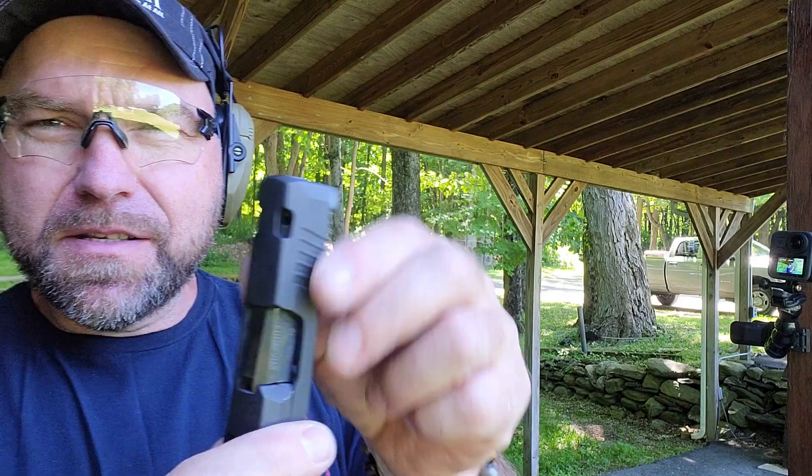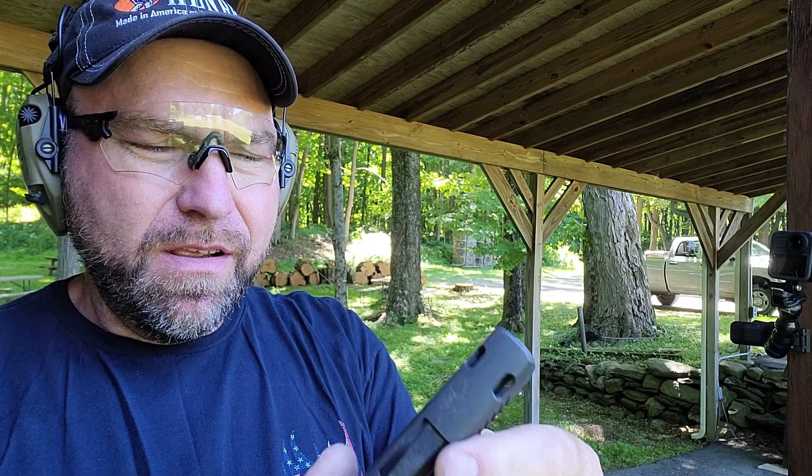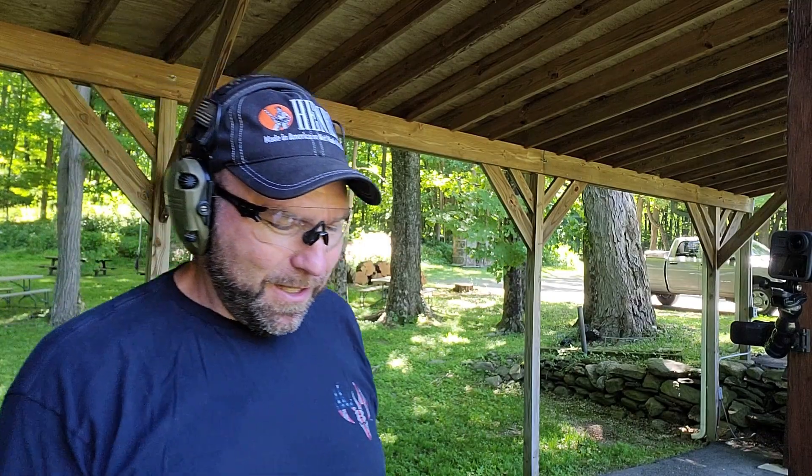Let's compare them. The SAS has two little ports and you can see the holes in the barrel. Let's take the barrel out — this is a ported barrel. The Spectre Comp barrel ends right here and is supposed to be working as a comp. One thing it sure works as is a lead depository when you shoot lead bullets, so it has to be cleaned.